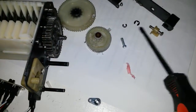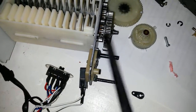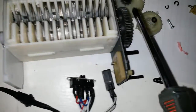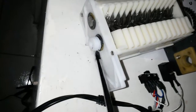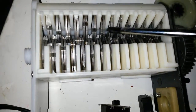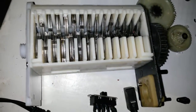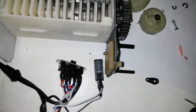A couple of screws here, a couple of little circlips there to come out, and the gears came out. The metal gears on this side are actually looking great - quite a nice set, three of them actually. On this side just some circlips for the shafts going through, holding these metal pieces here. They're all offset at different angles, so they all basically grab at different times, reducing the amount of power drawn at any point in time.